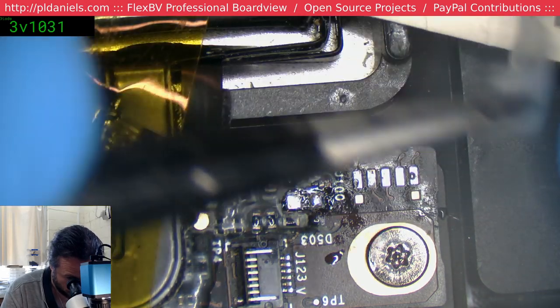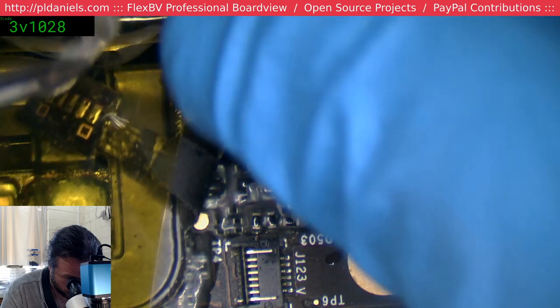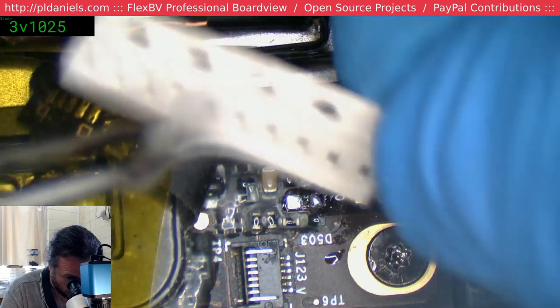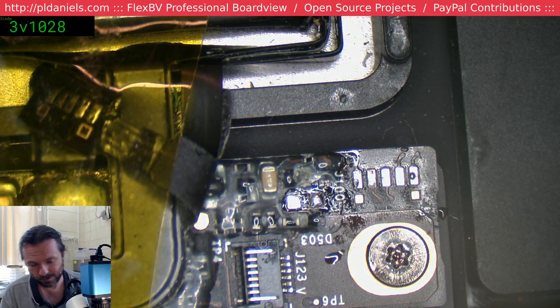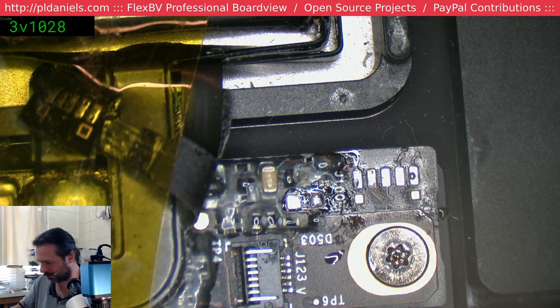Oh, man. I'm out of these almost. I've only got 1 left. 2 left. This is not good. And I was wrong. They're 603s. Alright, if they're 603, that changes things a lot. That could be 10 microfarad, 25 volt. Yeah, it's a bit difficult to tell. And unfortunately, I cannot determine what they are from the old one. Unless someone happens to have one of those and they can rip it off for me.